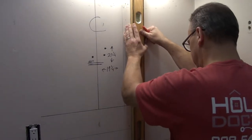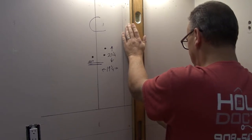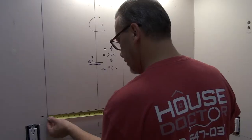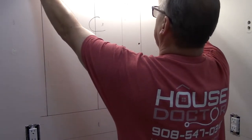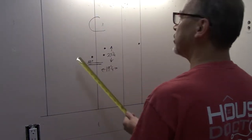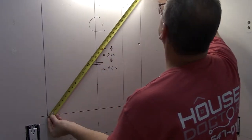Now that I have my marks for my left and right on my horizontal lines, I just take a straight edge and put it on the marks and draw a straight line on the left and the right side, which represent where I need to make the cuts. Just take your time, get it lined up, and draw your line right on the wall. Then I double-check measurements at the top and bottom for width, and left and right for height. I also take diagonal measurements — as long as both diagonals are equal, the box is square with right angles everywhere.